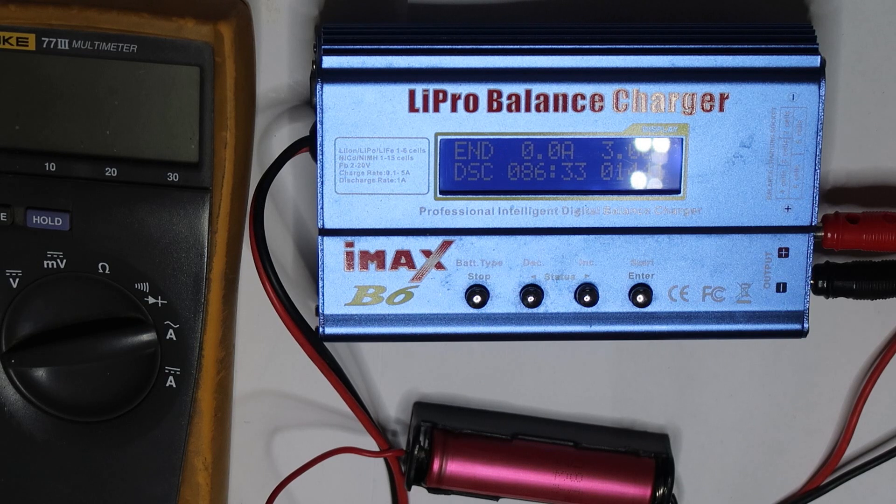As you can see, the real capacity is 1441 milliampere-hours, while the charging measured 1600. This is the reason you have to measure it this way to get the real capacity of any battery. Hope you find this video useful — you can subscribe and send a link to others who might be interested. Thank you and bye bye.